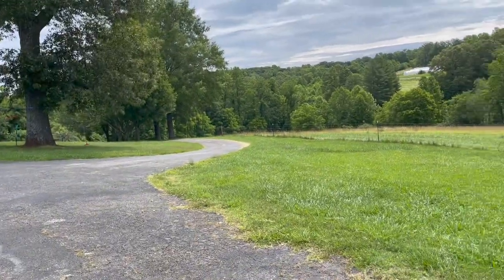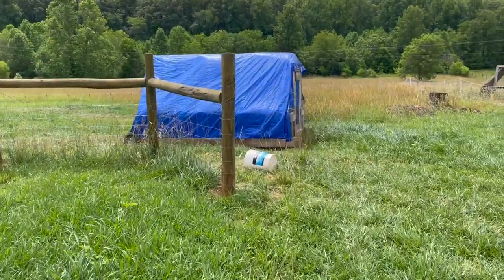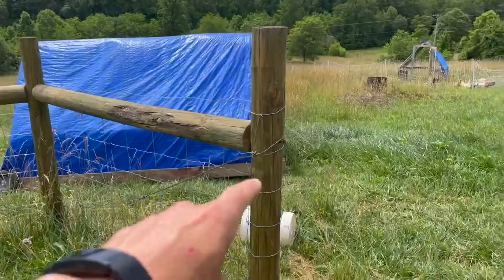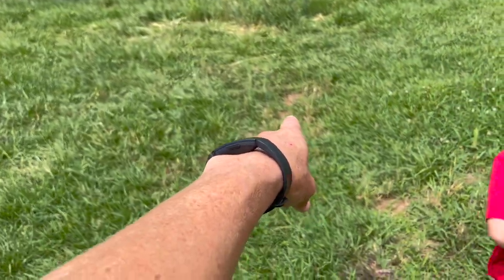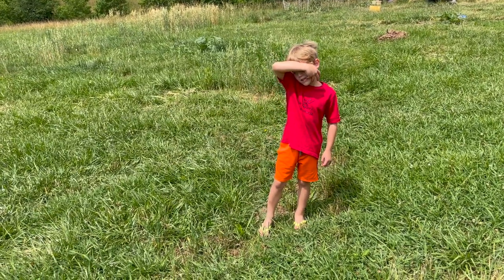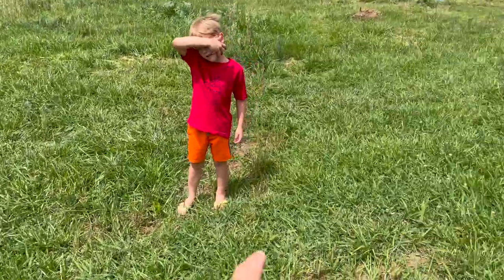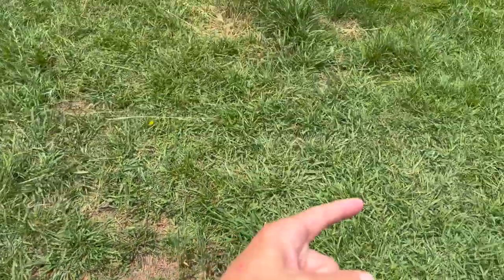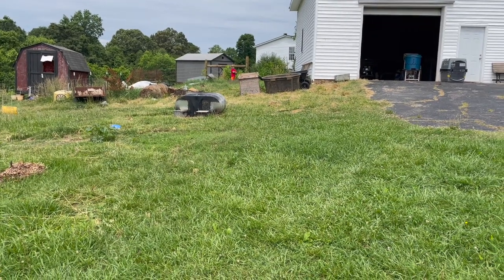This right here is the top of our property and as you can see we have a corner joint on our fence. We've actually done a lot of work on the fence line. This is going to be a gate — about 12 feet — and there's going to be another H brace here. There's going to be a livestock gate there, and then we're going to connect this woven wire fence all the way to that corner over there, which will shore up this portion of the fence.